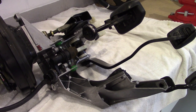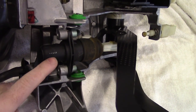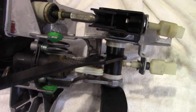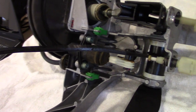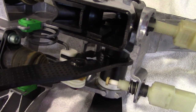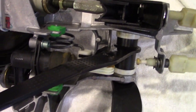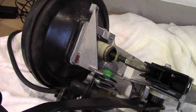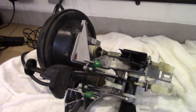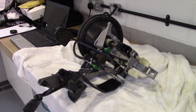The earlier pedal assembly on the Audi A6 C4 was quite complicated, but having a closer look at the C5 pedal assembly, it looks like it's been simplified. Here we have the clutch master cylinder which fits to the pedal. I'm pretty sure the clutch pedal itself is going to be too long and I'll have to shorten it, but I think I should be able to move that pivot up closer to the overall pivot. This whole cylinder can be mounted inside the car and should not get in the way of the servo. When I do the turbo build, I think I might do a Mark III pedal assembly design.